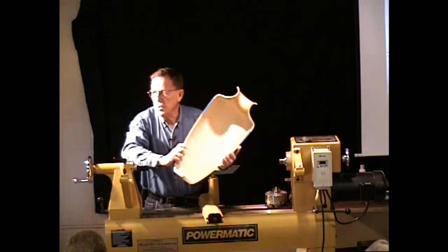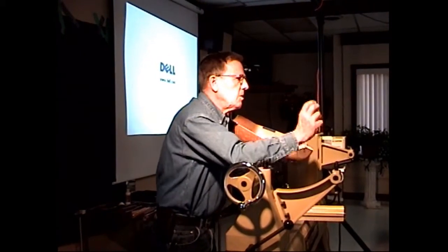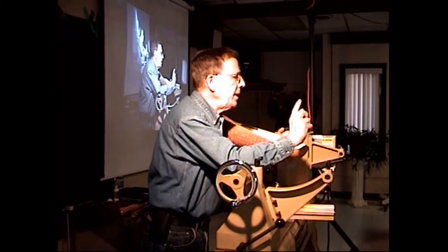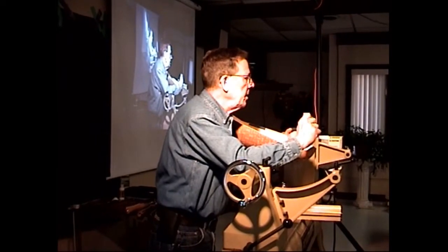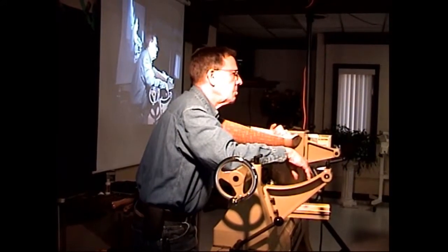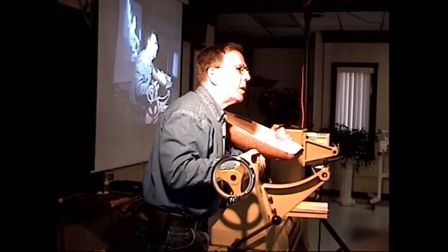There are 2 things that are really important, maybe more than 2. First of all, you use a foam brush and you don't buy the brush at Walmart. You buy a Jen, J-E-N, made in USA foam brush. It's a gray and it's a really fine foam. I get them from a place here in Wisconsin, an art supply place. You go on the internet and you can find them for a fairly decent price.